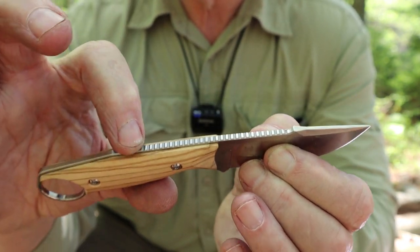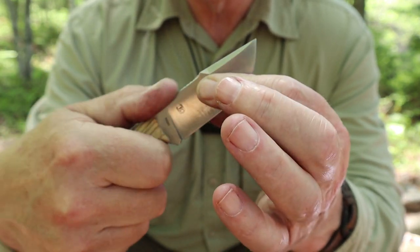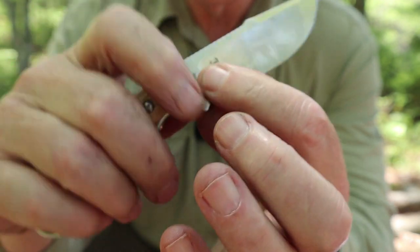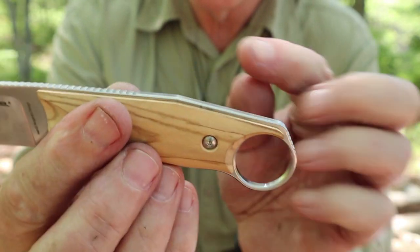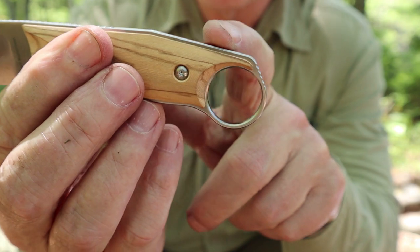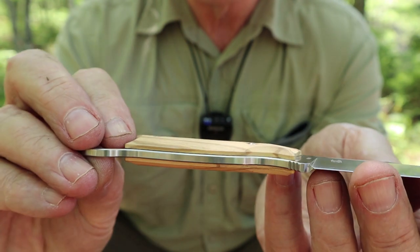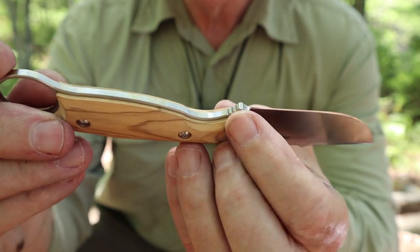There's jimping from about mid-spine on the back to about the middle of the blade — light jimping. Why so much jimping right along there? Well, it's because if you're holding this to skin with, that area gets a lot of thumb contact. There are thumb scallops on the wood as well. You can hold it like this or like that quite comfortably — it provides a little extra control. The spine of the knife is proud, meaning it sits just above the wood. That's an aesthetic, not necessarily functional, but it goes all the way around the knife. The scales are removable with tiny torx screws, so if you wanted to remove them and put something else on, you could. There's also a tiny bit of jimping right at the choil.